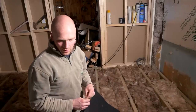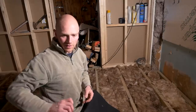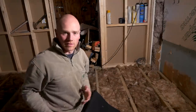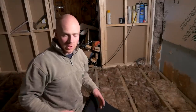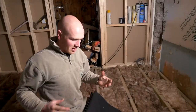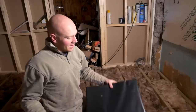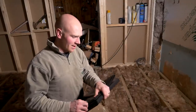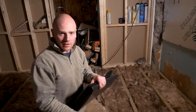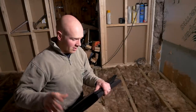People talked about using a breathable membrane in the house when I did that job, but it just doesn't make sense to me. Why would you want warm vapour going down into your insulation, which is cold, and potentially causing interstitial condensation, rotting joists and all sorts of nasties? I've got a cellar, so I've been able to go underneath and check, and the way I've done it has been bone dry for five years — no issues at all. So that's the exact way I'm going to go now.